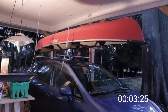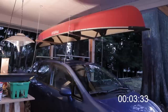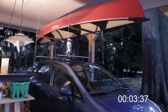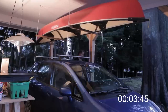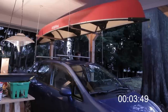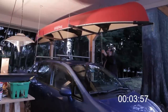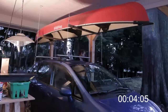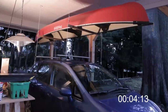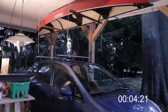There are definitely a few lessons learned on this project. Number one is that I probably needed bigger hardware in general — bigger pulleys, bigger bolts. Don't be shy about it, you're not going to overdo it. The whole system really does need pretty substantial hardware and I'll probably go back and replace all the pulleys at some point. Secondly, I found I needed a lot more little bits and pieces than I expected — carabiners, eye bolts, different pulleys. I ended up spending a lot more than originally planned, probably more than double. I think it came in somewhere between eighty and a hundred dollars, and that's not even counting the original hardware I traded out.